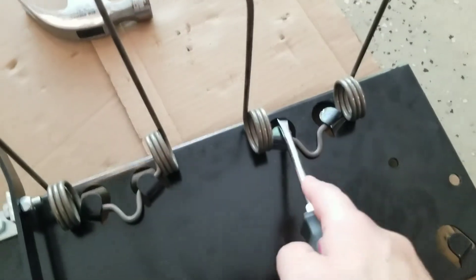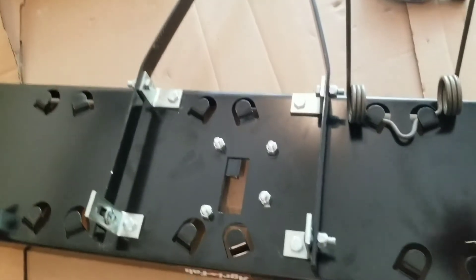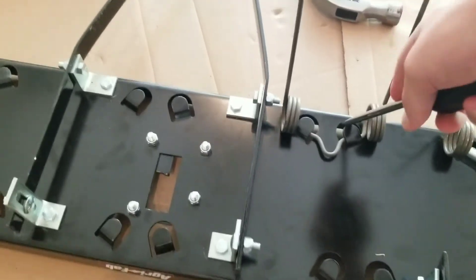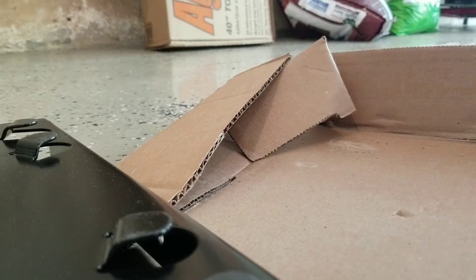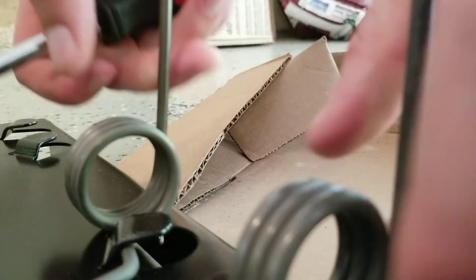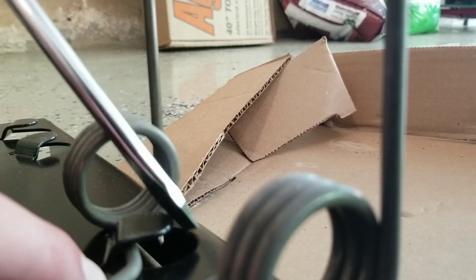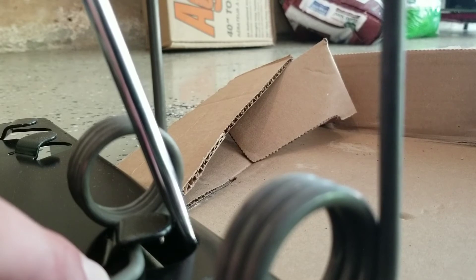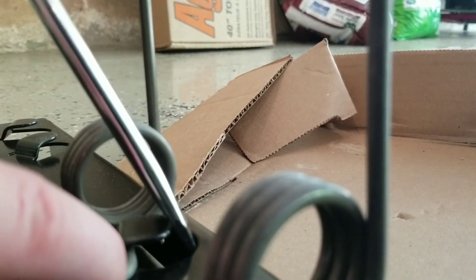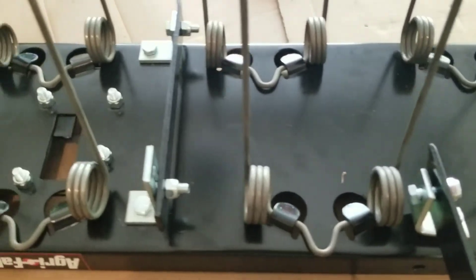This is the portion of the build where I started to struggle — I realized I did not have a big enough screwdriver, so I had to go to the store and pick one up, which definitely made it easier. You're really going to want at least a six or eight inch screwdriver here. You have to position the tip of the screwdriver perfectly in that slot and then pull back; if it's not quite right the tab will not give and the screwdriver will start to bend instead of the tab. Here you can see me put the tine in, pull it back a little bit, slot the screwdriver in — I go a little bit too far so it doesn't want to bend, so I just pull it out a little bit and there you go, it just bends over perfectly. You want the tab roughly level with the base of the bracket, and you start with the front ones first and work your way back so you don't get stabbed by the tines.